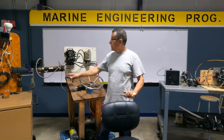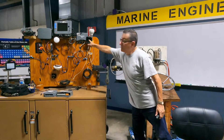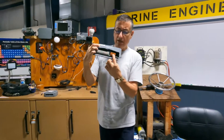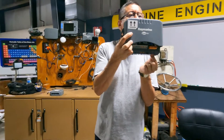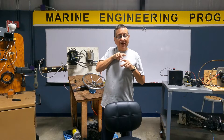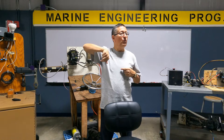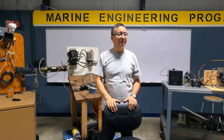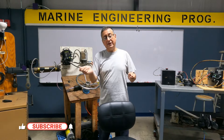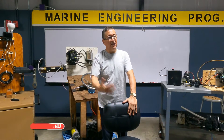For example, this one is an electrical servo cylinder and the electrical signal is coming from the computer in the position motor. You see the first position motor, motor A and B. In that position the computer sends the signal — look at this — A and B, positive-negative or negative-positive, and the servo goes one way or the other because you reverse the polarity. If you disconnect those cables and connect to positive and negative, that actuator goes one way or the other depending on the polarity related to the connection.